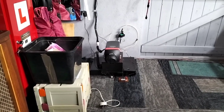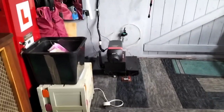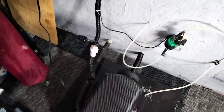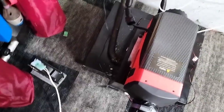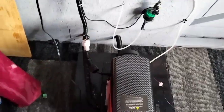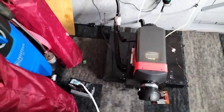I managed to poke it out — maybe a quarter of a handful of muck, but I wouldn't call it soot; it was more like bits of rust, kind of reddish. I got all that out, cleaned that section, and reassembled it. There's a bit of a fiddle because of how I've mounted it — I had to pull the exhaust pipe out a bit. You can see it's come out a little from the wall. There are two 90-degree bends in it, and the air intake from outside didn't behave itself going back in, but we managed to get the job done.